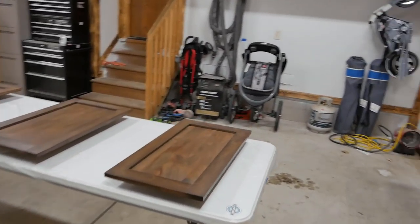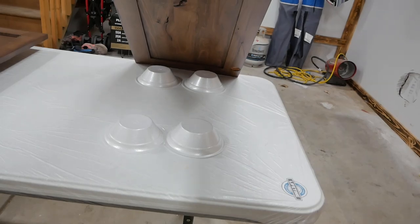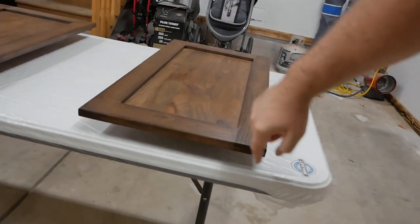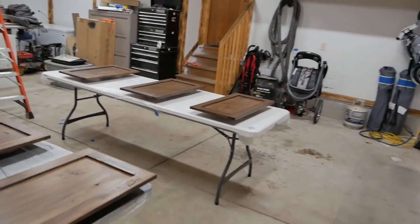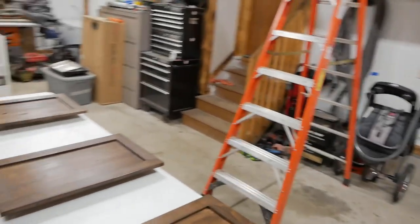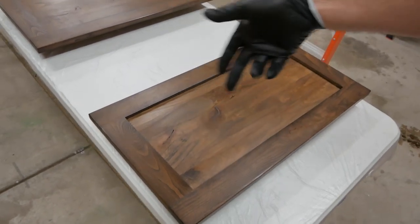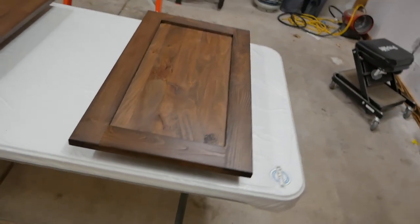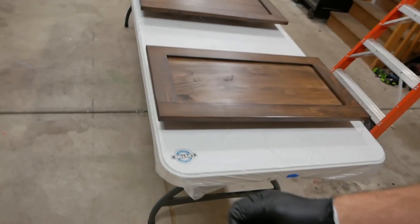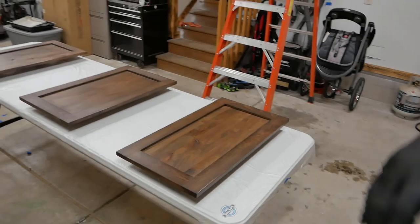Let me show you real quick how I have everything set up. I've already cleared the backside — it's been drying for over 24 hours. I've got some styrofoam bowls down there to keep the doors up off the table so I can be sure to get all the sides covered. I'm going to go around one by one and start clear coating them. The tip size I'm using is 1.5 millimeter. For the inside vertical edges, I'll do a quick swipe across each one since spraying from the top won't cover those well. Then I'll hit the outside edges, and finally spray the entire cabinet from the top.